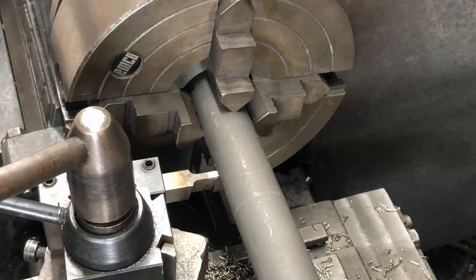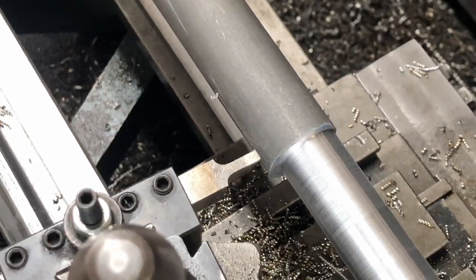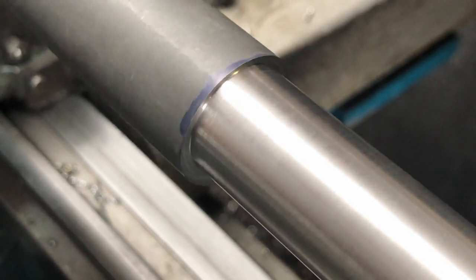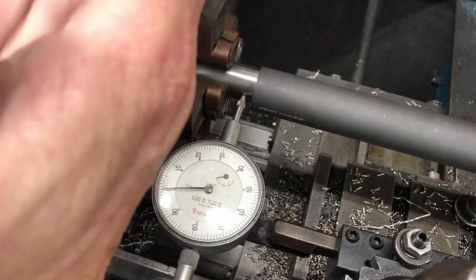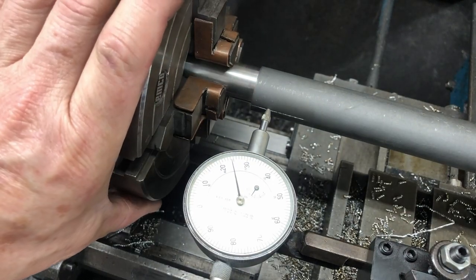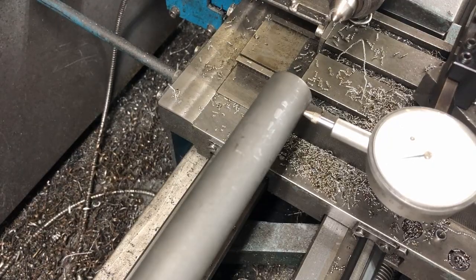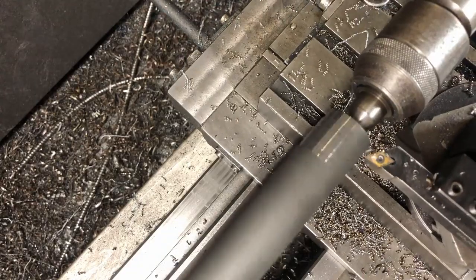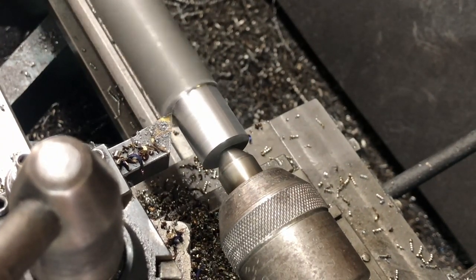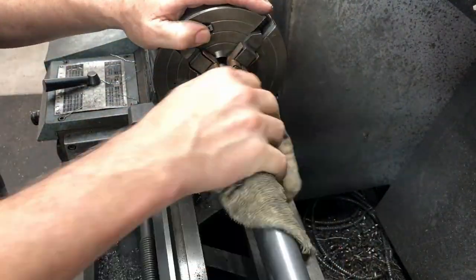When I turned the first end I actually took that mark off — it wasn't long enough — so I'm using the mark on the other end and scribing that mark back on the turned end. Here's a clip of the finished first end. I flip that around in the four-jaw chuck, dial that in to within a quarter of a thou, then check that I have 125 thou again at this end and make sure it's parallel — 125 thou at the other end as well. Very carefully I put a centre in and bring up the tail stock to turn that end down, giving me two eccentric ends that are in alignment with each other. I give the bar a clean up with fine sandpaper because a part will slide on here.